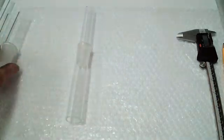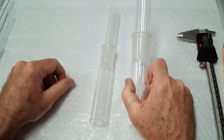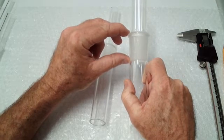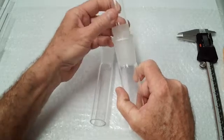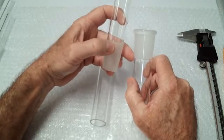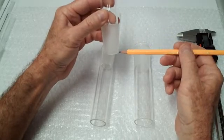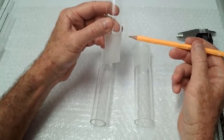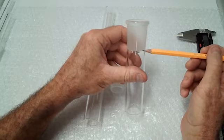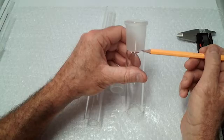This is a full-length 2440 joint. And this is a 2942 — for this joint it's 42 millimeters long. You know the diameter reduces 1 millimeter for every 10 millimeters, so 42 millimeters means it's actually going to be 4.2 millimeters smaller in diameter at the bottom than at the top. So the opening down here is 29 minus 4.2, which is 24.8.